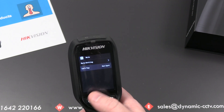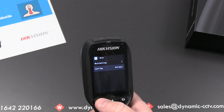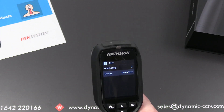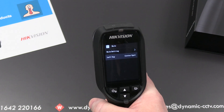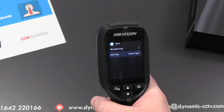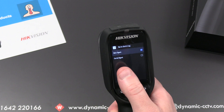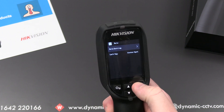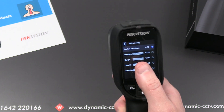I always favor the center cross as the area for temperature reading because it's easier to control when measuring an individual in front of the screen. It also eliminates the unit picking up hotter areas around the outer edges of the image and giving a false reading. You can also ask the unit to show the hot spot and cold spot on screen. Emissivity is set to custom at 0.98 out of the box, which is right for humans.